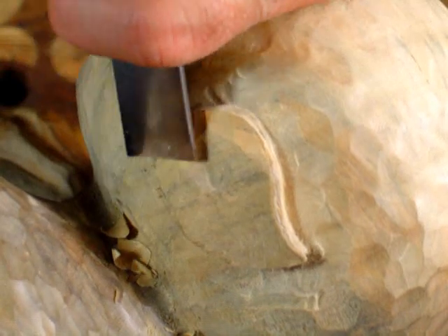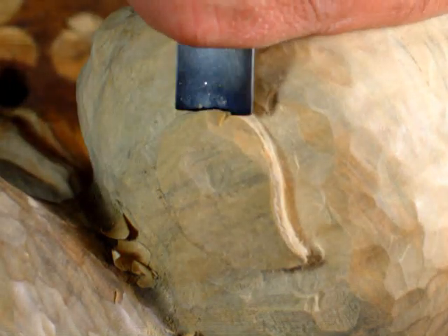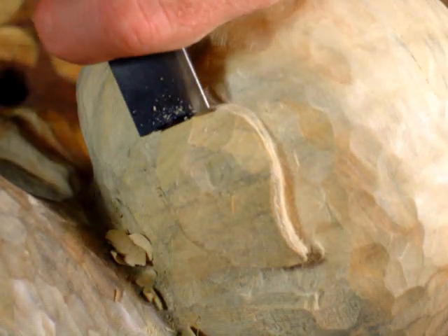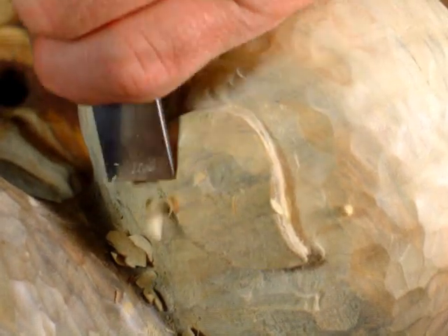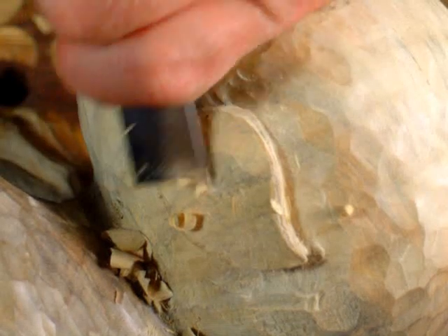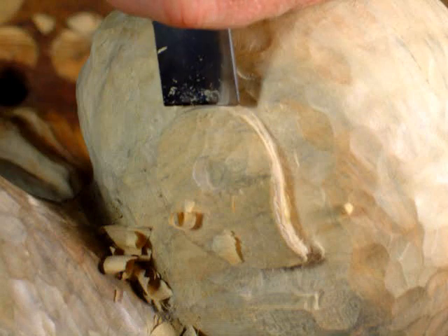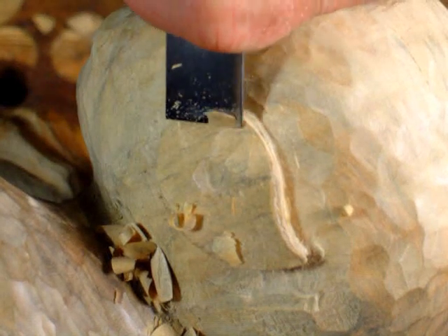Alright, so I'll do this pretty gradually in stages. I want to leave enough for some ear holes. I could feel it biting there — it was going to take off a chip. So I want to be slicing at this point, and I think slicing down is the way to go. I could slice down or I could slice up, but I think I get a little bit more control going down. So I will take probably the front third, maybe the front quarter of this ear down to within probably a sixteenth of an inch of the head.